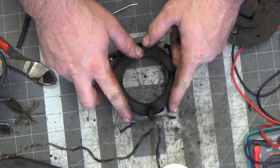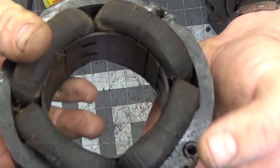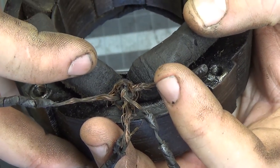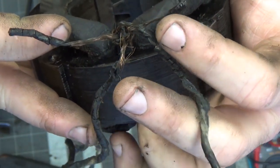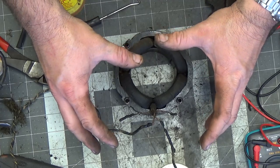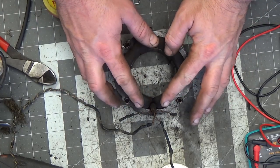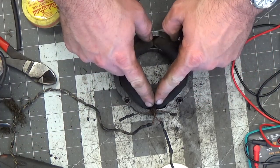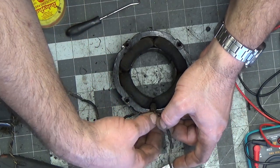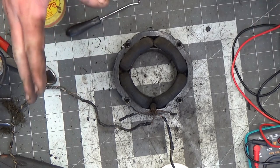I've chased it down and confirmed these two wires do not work, but I don't want to cut anything unnecessarily in case I need to come back to them. These four wires seem to be insulated from one another at this point. I'm going to trim them back and pot them — use some shrink tape to keep them separated. For the active wires, I'm going to solder the new wire on and use heat shrink to insulate them. That's going to be my method.